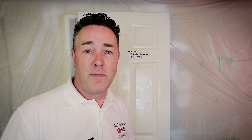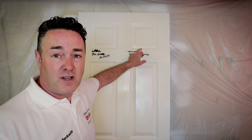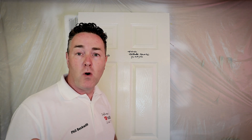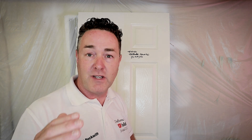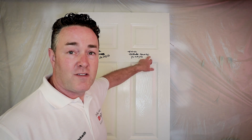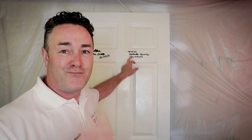Does paint quantity really matter if you're only looking at a 20 to 100 pound difference on the bill? The real question is: what do you think to the hybrid paints that go a little bit yellow compared to proper acrylic-based paints? I want to know what water-based paints you're using. Are you liking the Bedec? Are you liking the Benjamin Moore Scuff-X? As a satin/eggshell finish it's lovely — 108 pounds for just under four litres, but that paint is beautiful, re-coatable in 20 minutes to an hour, and on a par with oil-based eggshell. Tell me your views — see you on the next one.